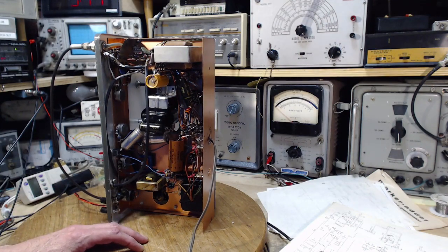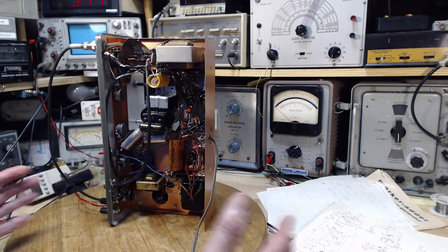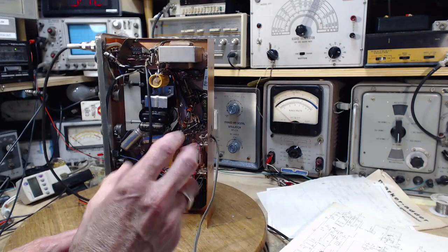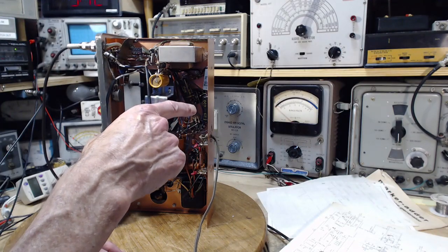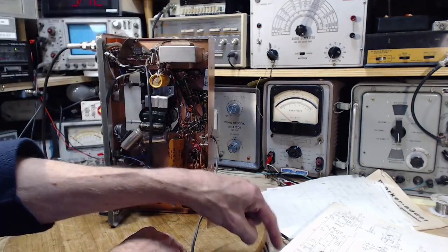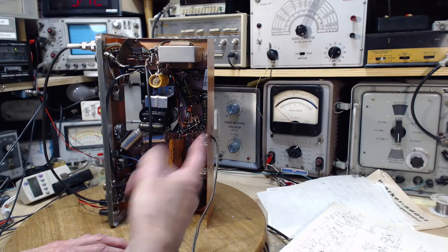If you hook up a particularly wired, that's a stupid way of saying it. If you take, in the power setting, in the industrial setting, often the primary side of these big transformers are star wound. So you have a star winding with a neutral in the center, which is often grounded. Grounded by rods into the soil, grounded by bonds going back to water mains, hydro neutral, anything, everything. Well, it is a hydro neutral actually.